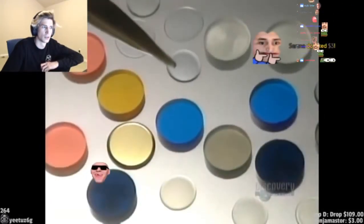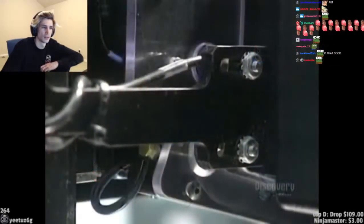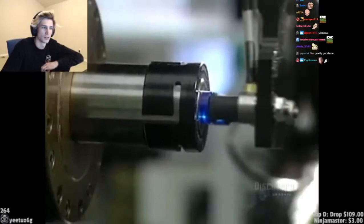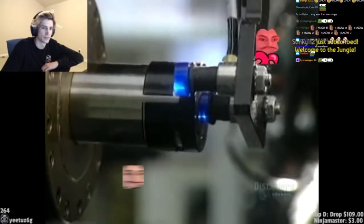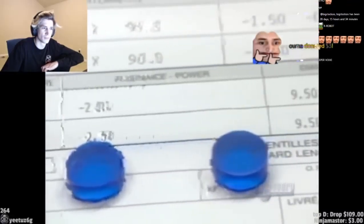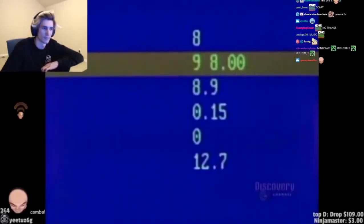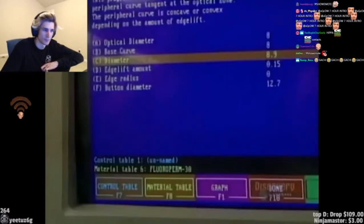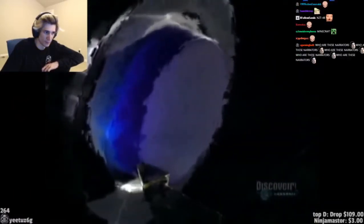Contact lenses have been in existence for over a century. At first completely rigid, they have now become gas permeable and as flexible as gelatin. These small polyhema discs are used to make soft polymer contact lenses in a variety of colors. We see here a patient's prescription, essential to the fabrication of lenses. The process begins with data processing control of the shaping. Data is supplied by computer, which controls a digital lathe.